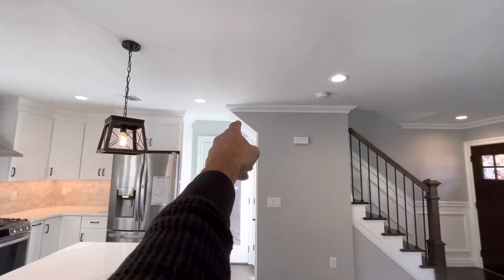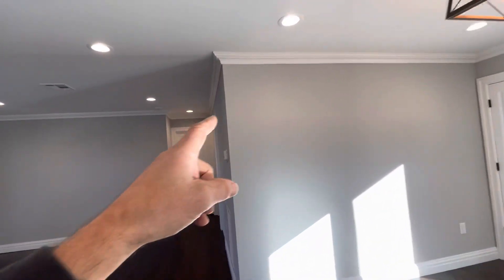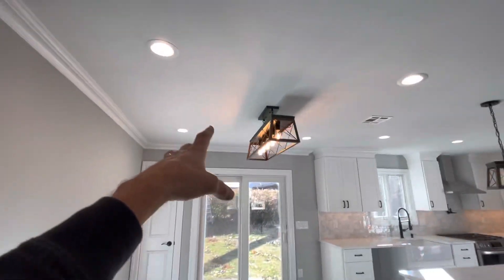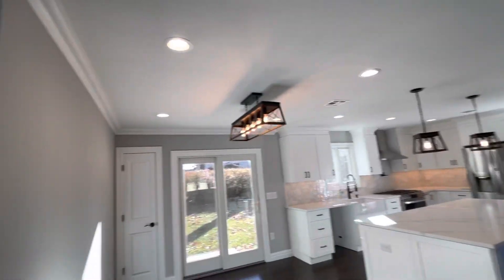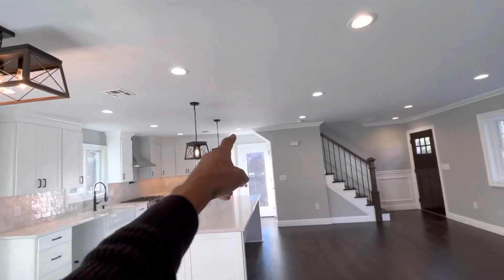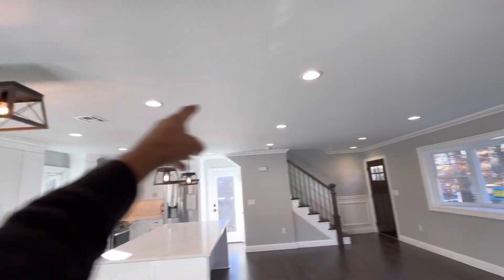In the ceiling, from the outside wall all the way across — 26, almost 27 feet — we have a steel plate in the ceiling. Brand new floor beams, obviously, for the second floor. And that steel plate spans from this load-bearing wall to over and above the door. We are able to create a nice flush ceiling.